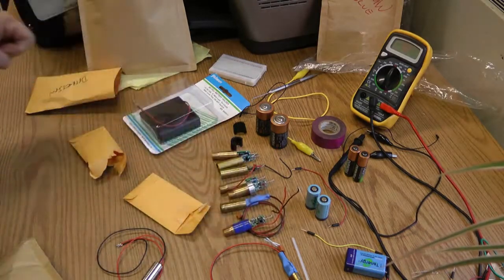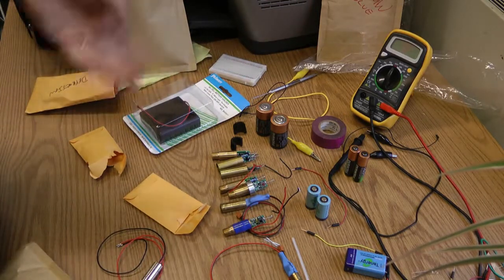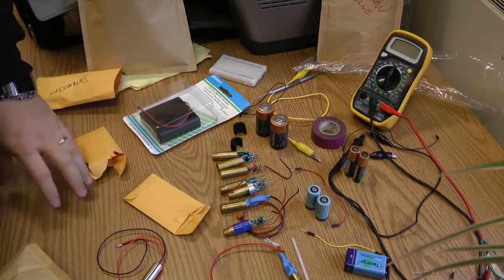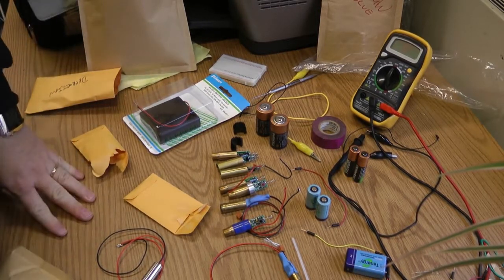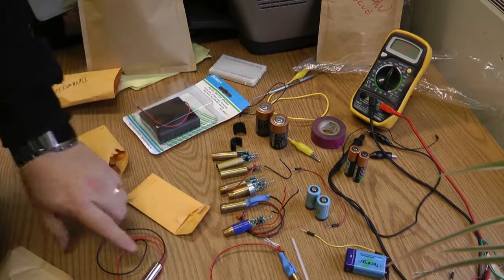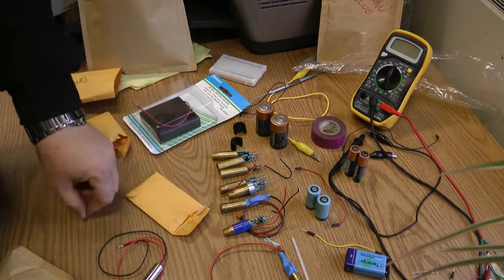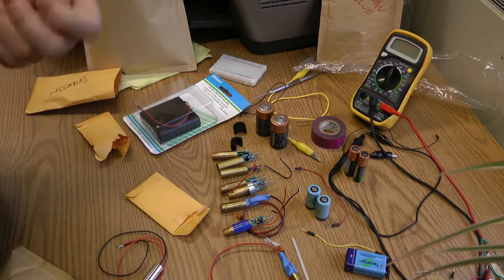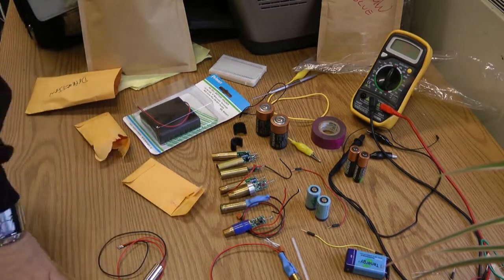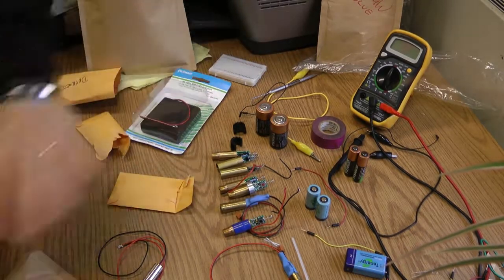There are all kinds of different lasers. Most early lasers used in home holography consisted of helium-neon lasers — not so much argon, though argon is good. Those were gas tubes. These laser diodes are a little different. I think they even created a red laser out of Jello once, but most use crystals. The green laser has an infrared laser diode that pumps through a crystal to give you the green light.